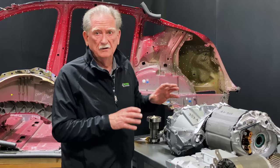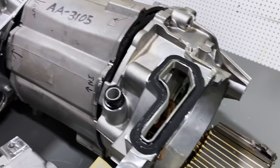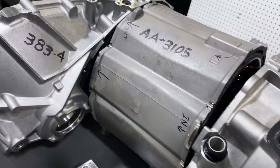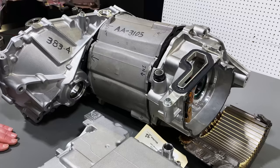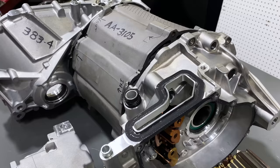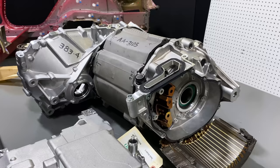Let's move on to the cooling strategy. Before that, let's talk about materials. These two outer components are high-pressure die castings in 383 or 384 aluminum — our machine read it sometimes as 383, sometimes as 384. The center section is a low-pressure die casting in 3105 aluminum. Volkswagen looked at whether they could go to an extrusion, but that turned out to be too much effort — probably too much machining and sometimes an extrusion comes out heavier. In the end, this is the way they went and it seems to work really well.